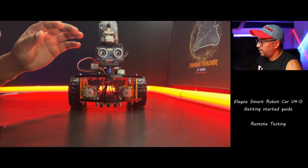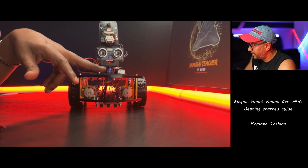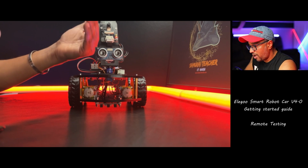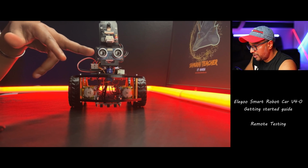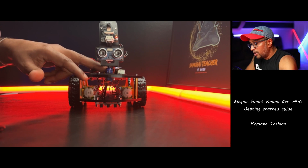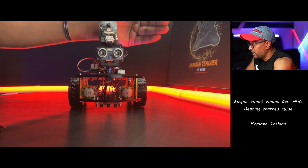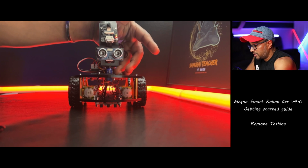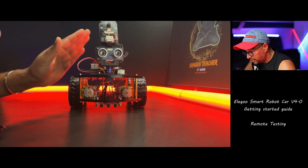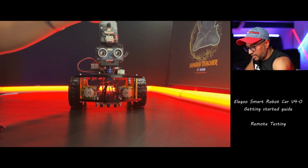So in here the ultrasonic sensor tries to detect the good part. The thing is the servo motor. The servo motor's program is to detect objects. That means if it detects an object from here, the servo motor says okay, turn left. So the servo motor turns left, the ultrasonic sensor also turns left and detects anything. If it detects with the ultrasonic, the servo will go back to the right, all the way to I think 90 degrees, probably 180 degrees from here to here.